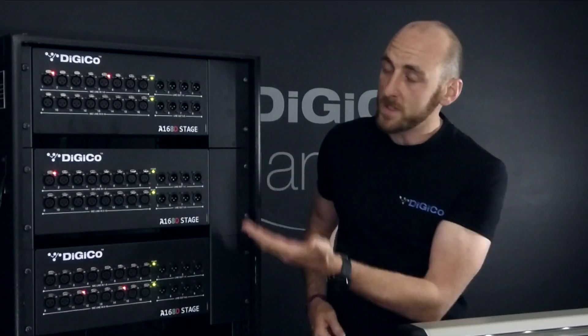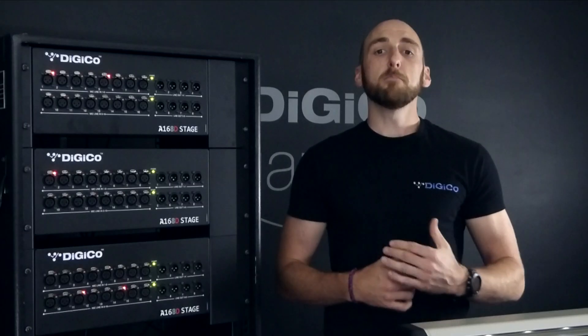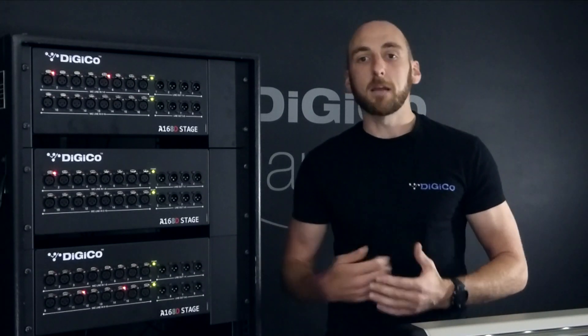First of all, let's have a look at the new A168D stage box. The A168D is a 4U rack mountable stage box that has 16 mic line inputs and 8 line outputs. As standard it comes as an efficient remote stage box that you can easily place within a wide range of installations, be it next to your drum kit, behind a lectern, or in a conference center. The flexibility and power of the Dante network paired with our premium IO solutions and Dante enabled consoles provide the ultimate install solution. All of the A168D functions — phantom power, gain and pad options — are controlled over the Dante network from one of our consoles.